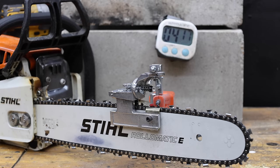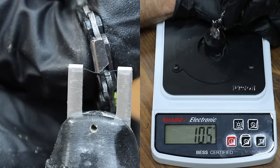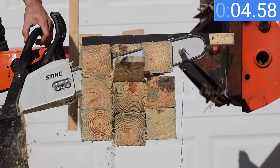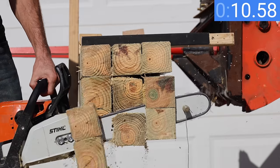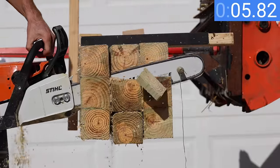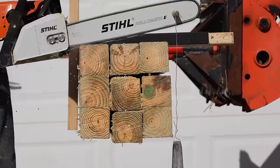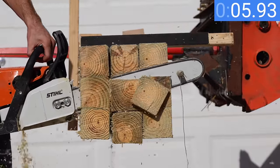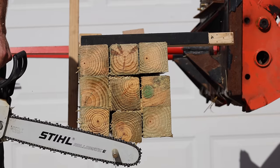The Kronberg is the fastest sharpener yet at just over 4 minutes — very impressive. The chainsaw teeth sharpened by the Kronberg are extremely sharp, performing very well on the sharpness tester, similar to the Stihl. In the log test, the Kronberg scored 11.46 seconds on the first cut. With the burr worn off, it improved to 11.1 seconds on the second cut, and made the fastest cut of the three at an impressive 10.8 seconds on the third. The Kronberg is getting faster with each cut and holding a very sharp edge.